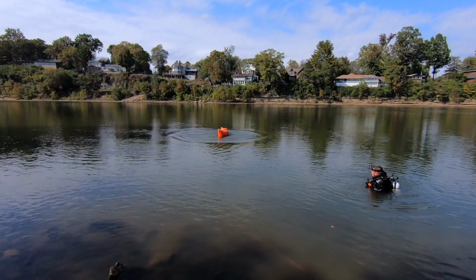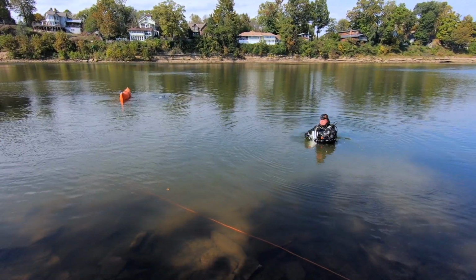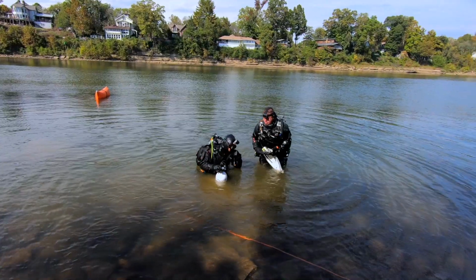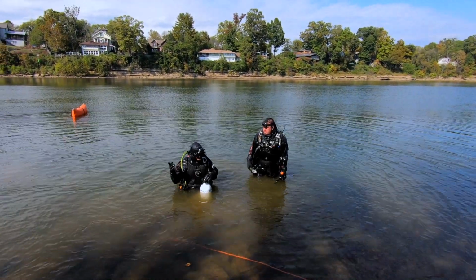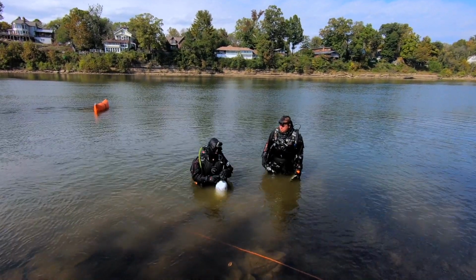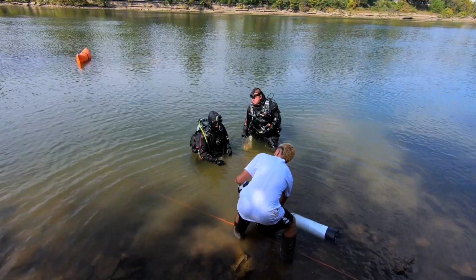All right, guys. If anybody doesn't know, this means he's okay. He's just messing with something right now. I have a little bit of air in both the bags. The back is up first because there's less weight. The engine is still heavy, that's why that bag is still down. This one's up. So we just need a little more air in the back. Really close.